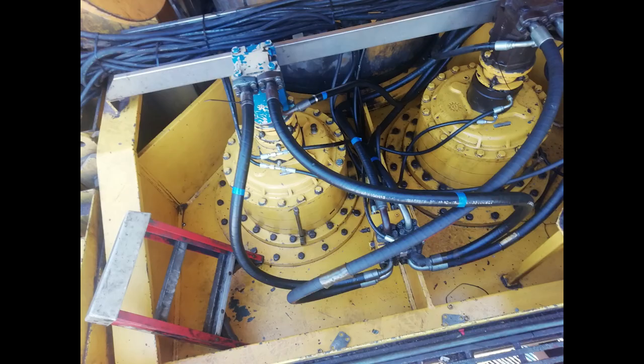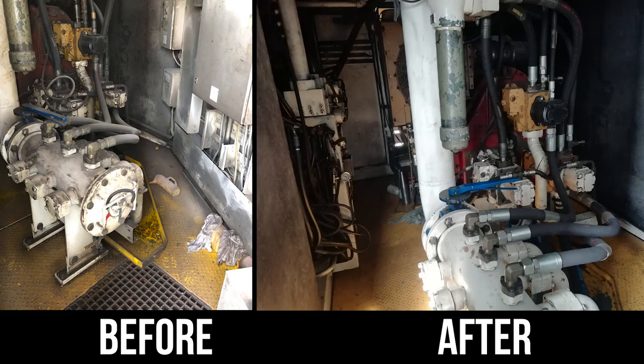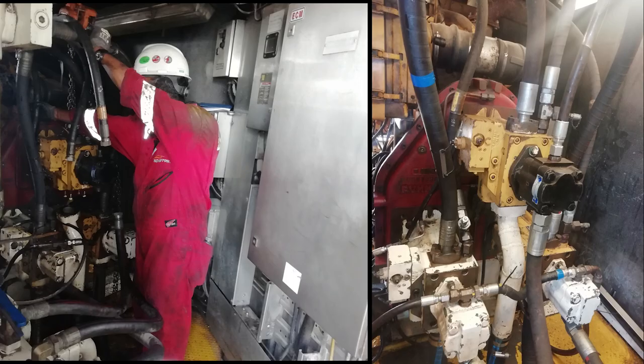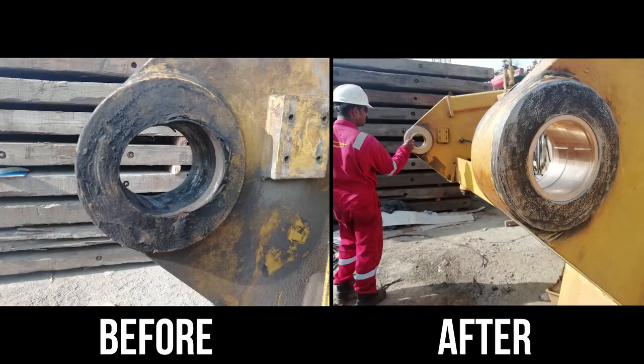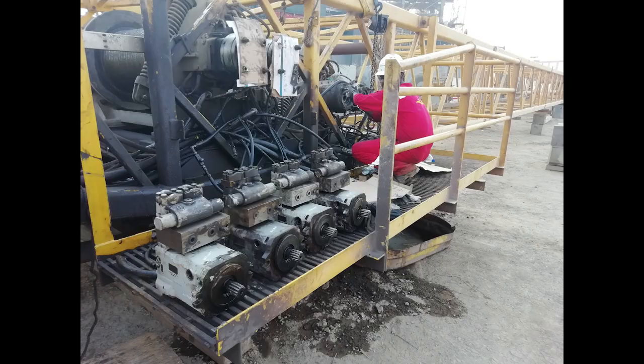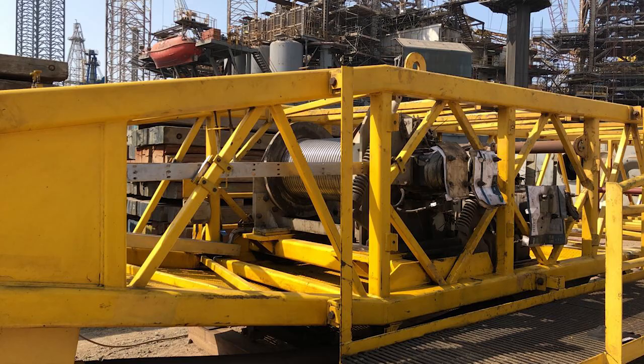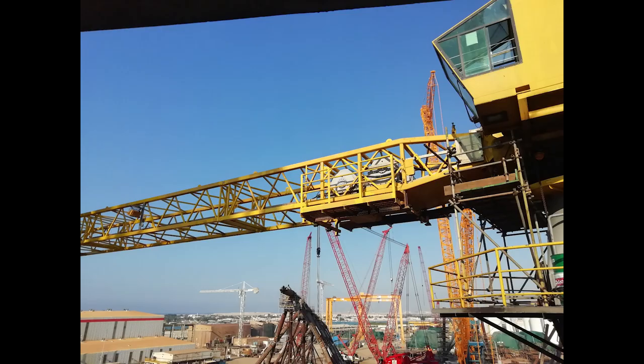The port NOV DN60 diesel hydraulic crane's boom is removed. The gantry and hydraulic systems are inspected and serviced. The deformed boom pinhole is remachined. All hydraulic hoses and bearings are replaced. The crane is load tested and witnessed by ABS.